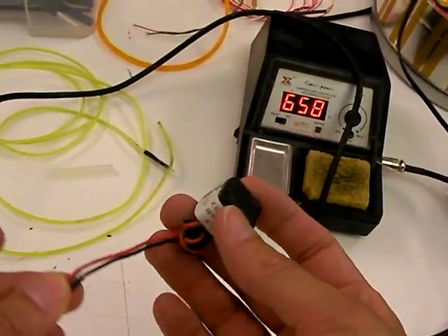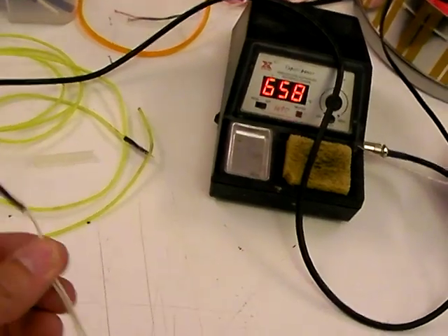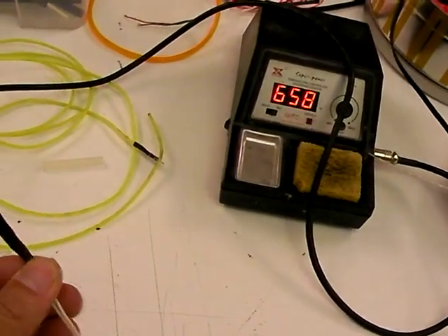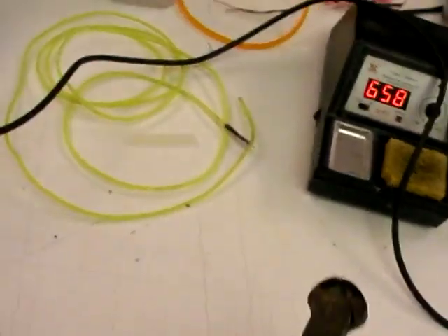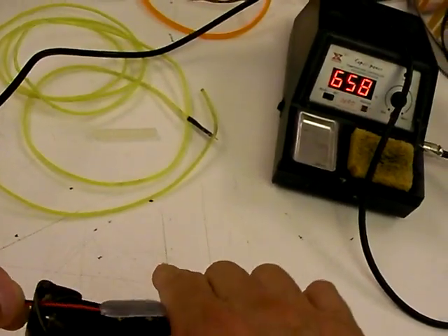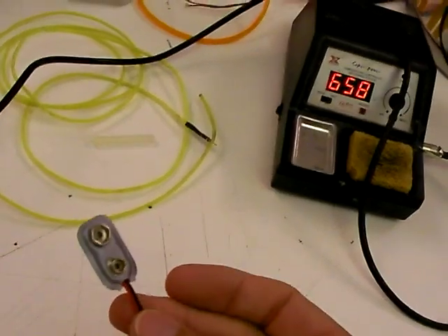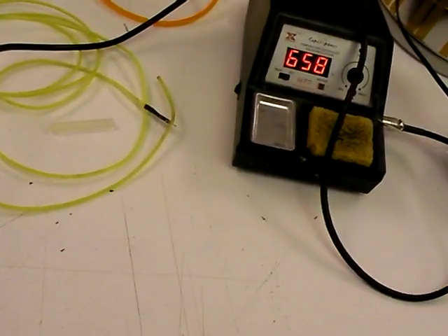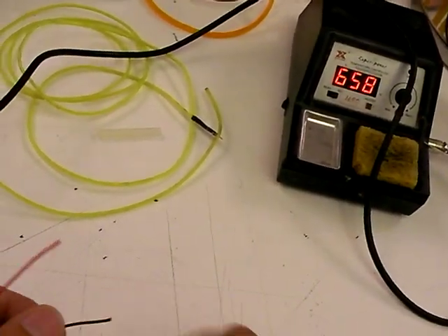This runs from the receiver to the inverter, coming in at 5 volts, and then it goes off to drive the EL-wire. We start by making this up, which is going to require a set of snippers. We're going to take off this little 9-volt connector — why they ship this thing with a 9-volt connector when it really does not want 9 volts, you fry it if you connect it to 9 volts, I do not know. So we're just going to solder this up.